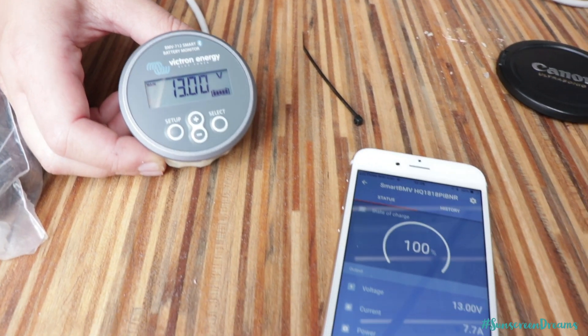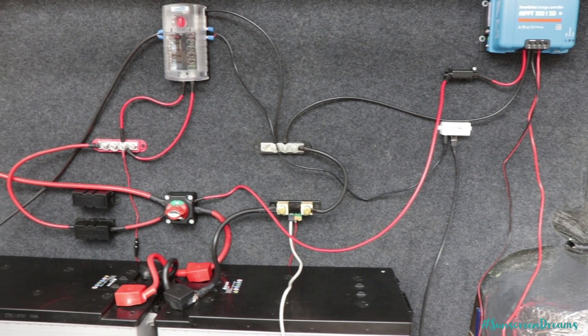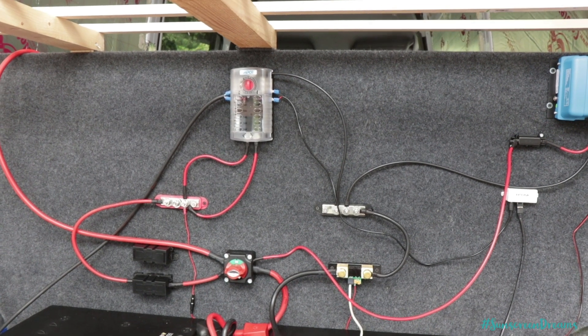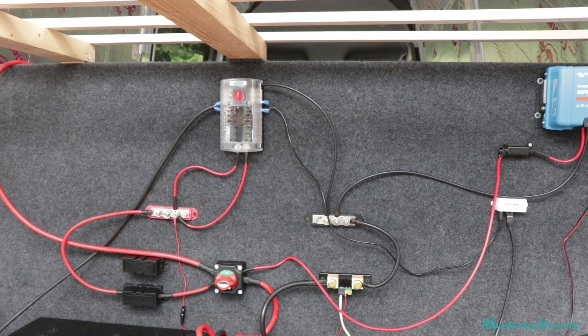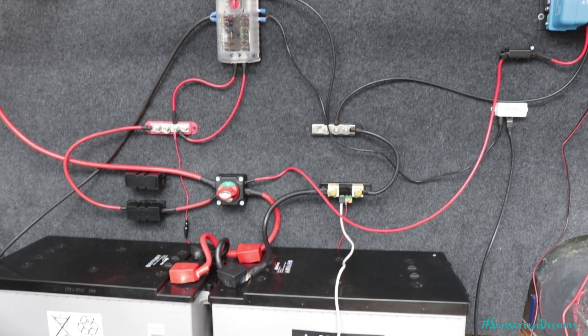That's now the end of the 12-volt side of the electrical setup. We've got a little bit more tidying of the wires to do, but from a 12-volt perspective all we'll be doing now is connecting all our 12-volt appliances to the distribution block, running cables throughout the van, adding in some blade fuses, and powering everything from the leisure batteries and the charge controller. If you have any comments or want us to go over any more details, we'll be putting a full list of all the components in the description below. Thank you very much to everyone who has subscribed — remember to hit subscribe and give us a thumbs up. Until next time, thank you very much for watching, see you again soon. Bye!